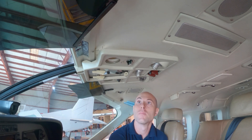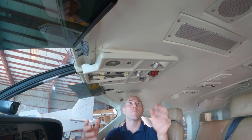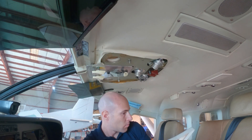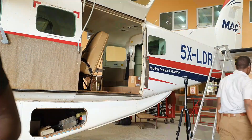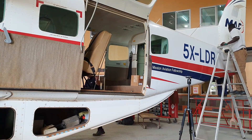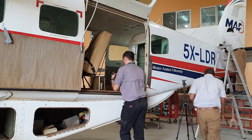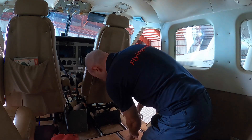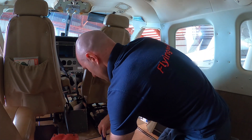To take the surround off I need to remove the air vents and parts of the light fittings for the pilot and co-pilot. After that we remove a few screws, some sealant, and the antenna comes right off. Now it's time to get the right-hand seat out of the cabin in the cockpit so we can get access to the wires that run under the floor and connect the Garmin displays in the front to the traffic computer in the back.